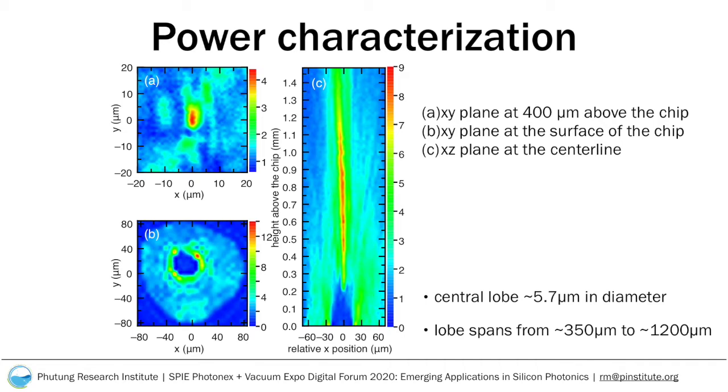While the device is perfectly circular, we note that the measurement data exhibits slight asymmetry due to the errors in the expected versus real movement in the flexure design of the translation stages. Nevertheless, it still shows the qualitative behavior quite well and as expected.